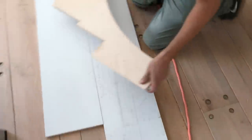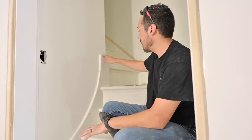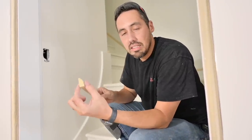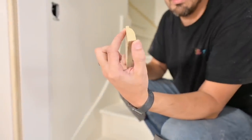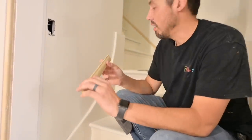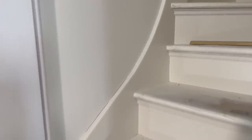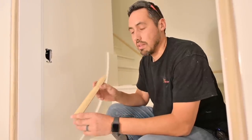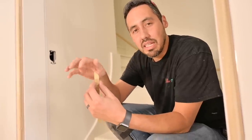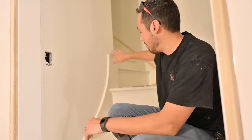That's what we have right here — I traced it, cut it out with the jigsaw and a track saw. Now this isn't done yet. We have a cap that has to go on top — it's nine-sixteenths thick by an inch and three-sixteenths tall. This is a small piece of trim, but it's not small enough to bend in that curved motion. So what we're going to do is something called bent lamination — we're going to take this piece of molding and cut it into little one-sixteenth to one-eighth inch strips so we can individually bend those to go up this curve.